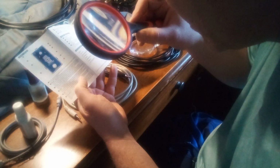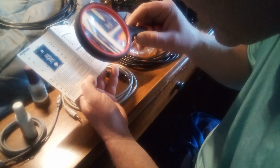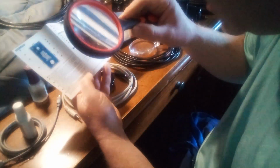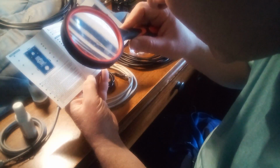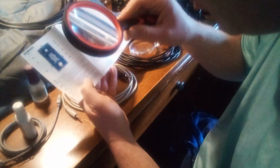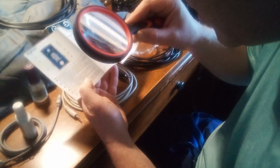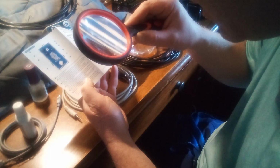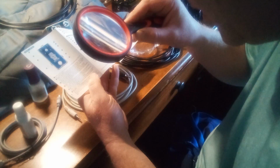At 12 o'clock position, the input and output volume balance, which may or may not be true based on how you turn these knobs and how hard your instrument or any effects in front of it are hitting. So, limit controls in, that's the one I put an I. Controls input attenuation and limit. When the input signal is too large and produces unwanted distortion, you can keep the signal clean by turning down the input signal through limit.